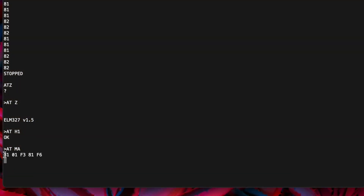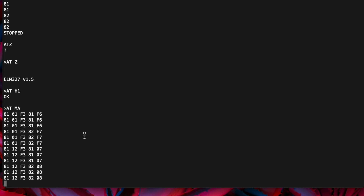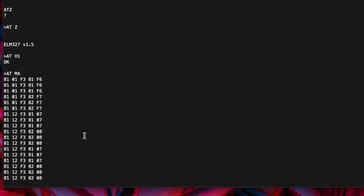As you can see, it's working for me. I'm seeing five bytes. I've got my length header, which is more than just a length — it's got some bit flags set in there too; it varies. You'll have to figure out what exactly these packets mean for your protocol. Following that, I have the target, the source, and then the data byte — in my case it's only one byte — and then the checksum at the end. And there you go, you've got your full packets now.